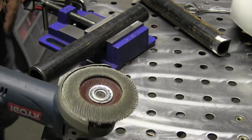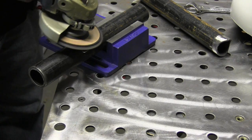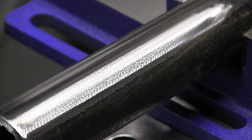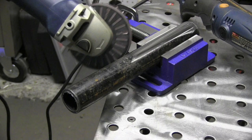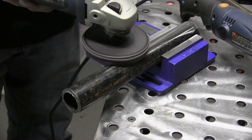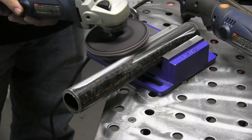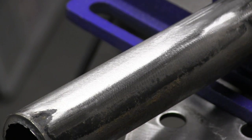This is a really common way to prep metal like this — just a four and a half inch flap disc, about 80 grit, on a four and a half inch angle grinder. It does a pretty good job because a flap disc has fresh edges all the time and prevents it from loading up with crud. This is a 3M bristle disc — kind of expensive, and for a lot of people probably not worth it because when you get near an edge it will sling those little bristles off. It's like a $25 or $30 disc.